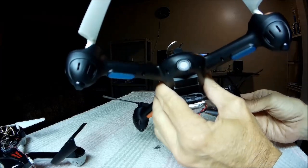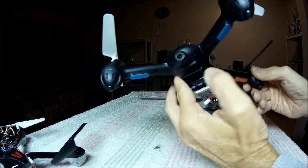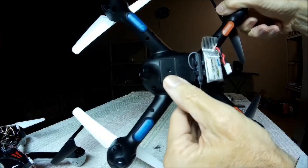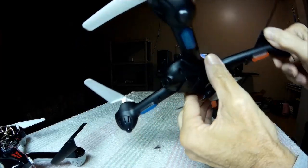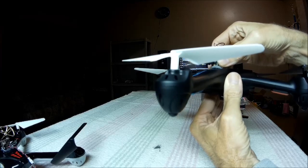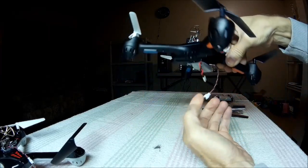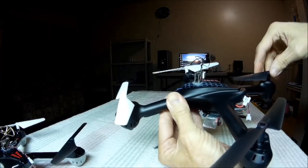You notice the camera on the front is much bigger - I think it's actually a 720p camera. And you have your Wi-Fi antenna right here. I had to put the battery in a different position because right here is the optical flow camera. We don't want nothing anywhere near that so it can do its job. So the battery is towards the back, and I moved the AIO camera - the AKK AIO - towards the front to kind of balance it out. I'll be running the cable from the side like this, and once it plugs into the battery it should still be well out of the way of the props.